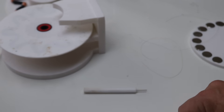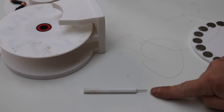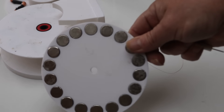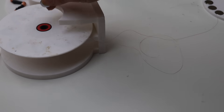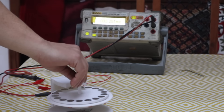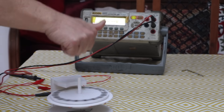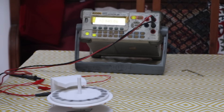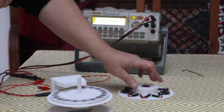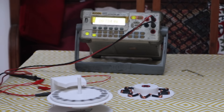This is the main axle - it's just a printed rod, but inside it there's a darning needle which I'm using as the main bearing. It'll rest on that piece of metal we glued in the bottom. You could change that bearing - you might want to look at magnetic bearings or an ordinary thrust bearing. That shoves through the magnet disc, and between the magnet disc and the coil we put a single washer. As a test, it spins really easily and for a long time - spinning it gives about 11 volts on the volt meter. Now we fit the second coil by removing the axle, sliding the coil in, and sliding the axle back.